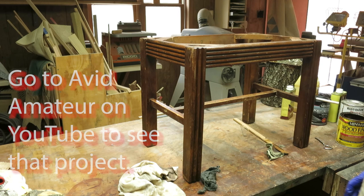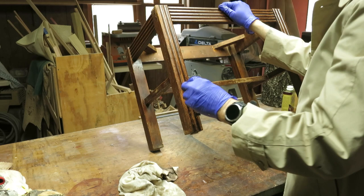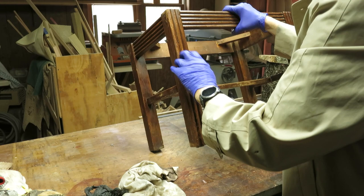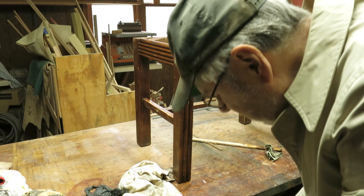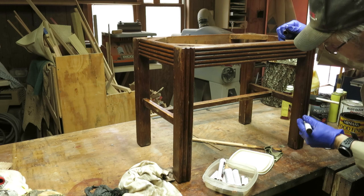The cracks were still bad after drying — I had to go over them with steel wool to get them clean. I'm going to be using Minwax Golden Oak. And for these little spots that are white where the finish is completely off, I'll be touching those up with a coloring pen — a walnut coloring pen. It works pretty well; it really darkens up the areas.